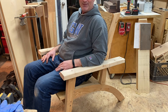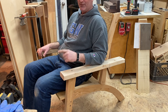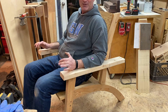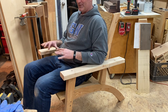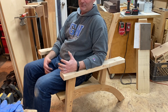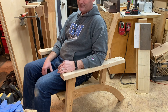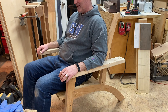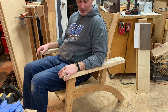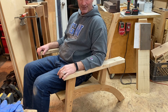Keeping all of this in mind when you make these things is super critical — you really can't rush it. If you haven't made a mock-up of your chair before you start building your design, you have to. This is such an important step and we're still in the cheap phase of building a chair. If you were to skip this and go right to your ebony or purpleheart or whatever material you're going to use without testing it out, it's going to be something you're living with for a long time — or worse, your clients are going to be living with. Hopefully those little tips and tricks were helpful. Really not much to it — a drill, a miter saw, an imagination. That's kind of all you need for chairs. Thanks everyone.